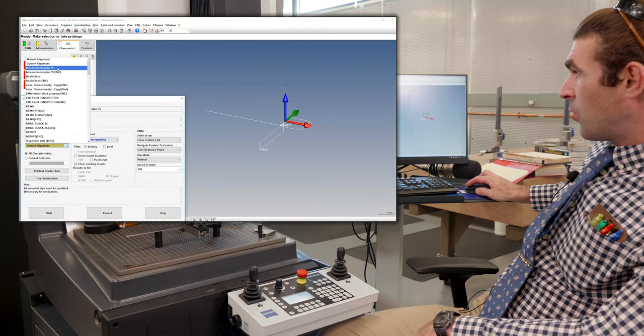The Mitutoyo square turns out to be not as square — not as perpendicular — as the Starrett square. The perpendicularity is almost two thousandths out of perfect. I'm sure it's still a fine tool and works just as well for most things, but there is a difference. You could argue for filtering outliers and using Outer Tangential Elements, which I should, but I've compared these two squares with the exact same program so there's still going to be a difference between them. That's it — a quick program, a different alignment approach, a manual alignment for a second part, and checking a few GD&T characteristics. If you enjoyed it please like and subscribe — more CMM videos coming soon.